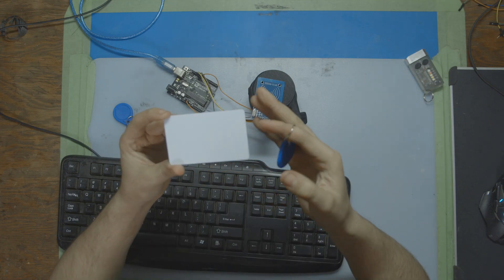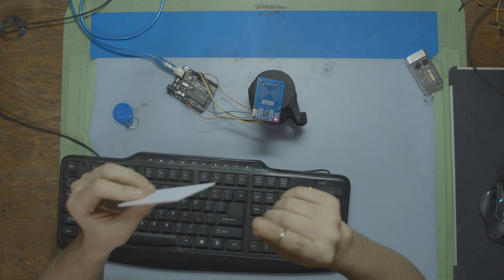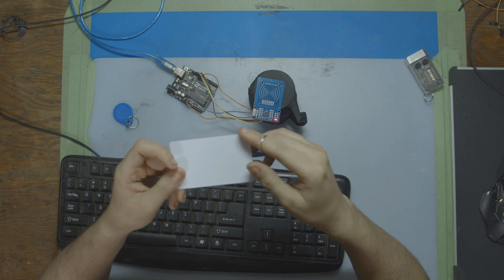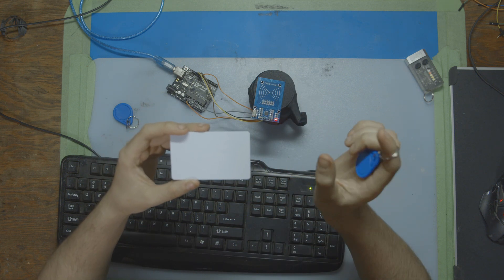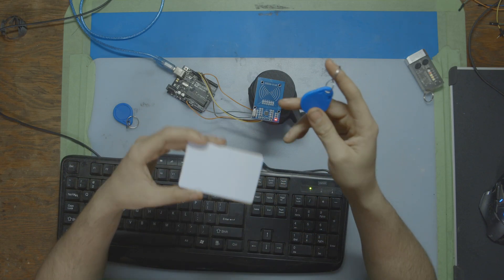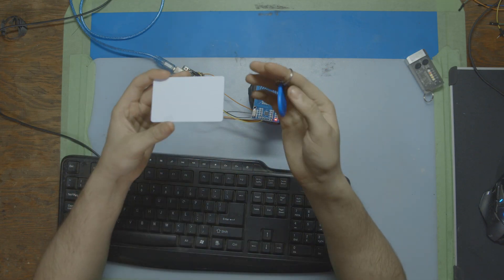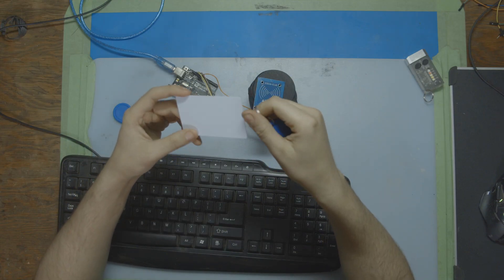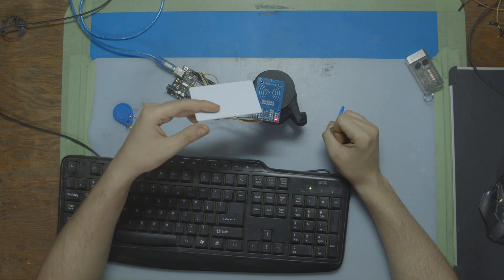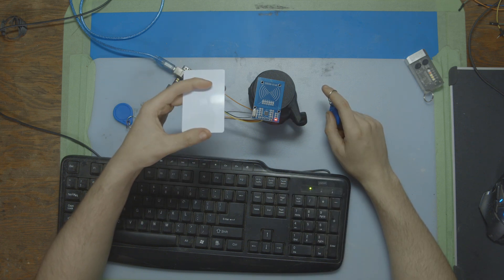It would also be cool that if a card is being used by somebody and you want to reassign it, you can just rewrite the information on the card. You can't change the unique identification number, but you can definitely do something creative with the data blocks. For example, instead of 'Testing RFID 1234' you could store an employee's name, and when that person leaves you can give the card to someone else and update the name. That's it for the basics of RFID — I definitely want to use this in more projects. If you have questions, let me know in the comments or join the Discord, and if you enjoy these videos give it a like and subscribe.